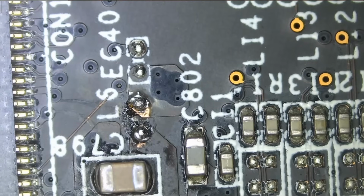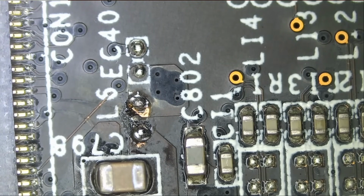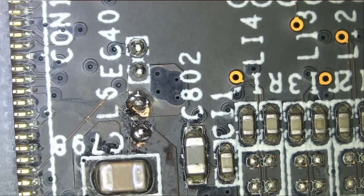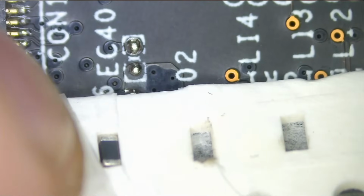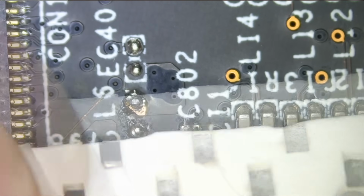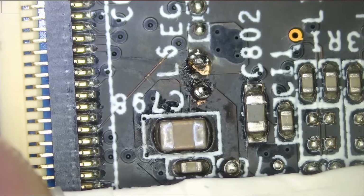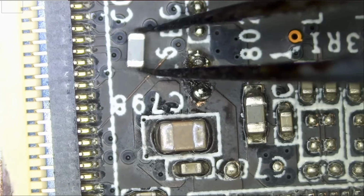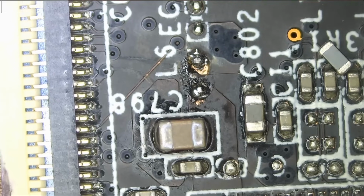This is the same size. Probably different size. Okay, so let's see, is this one the same? Yeah, looks like the same size. Let me grab this component here. Right now, since we do not know how that circuit board works, there could be a coil somewhere else on the board, but most likely there's a 90% chance that a coil exists here on this side of the board. Perfect size. So let me prep the board, since we still have unloaded solder on the board.